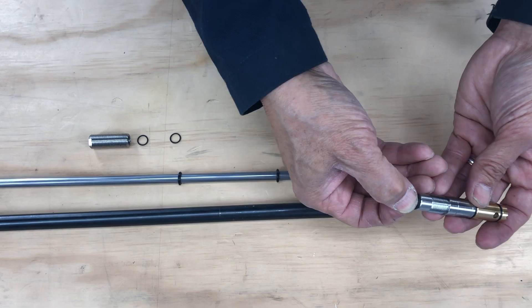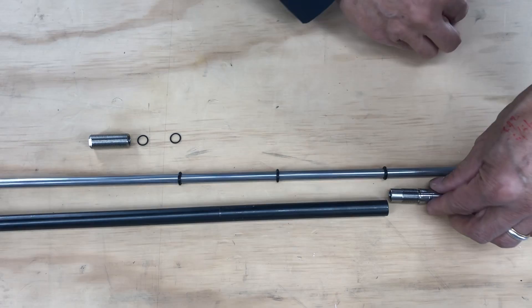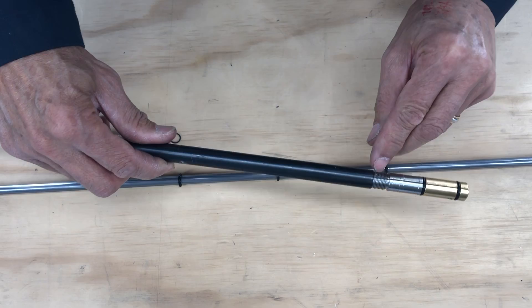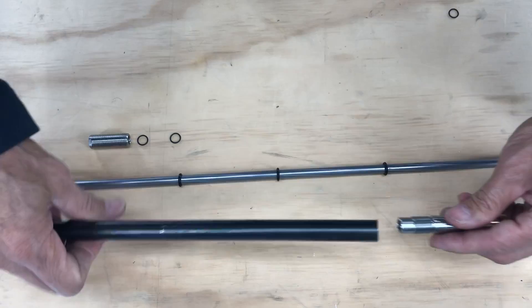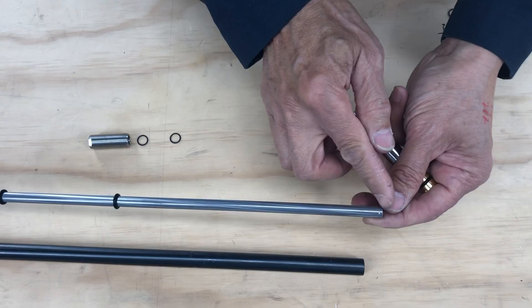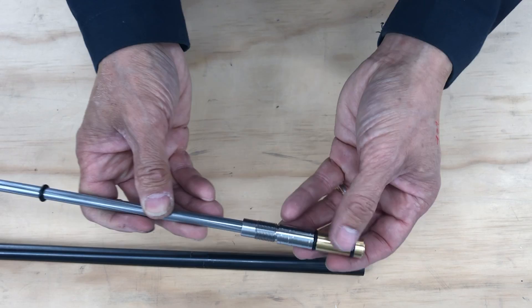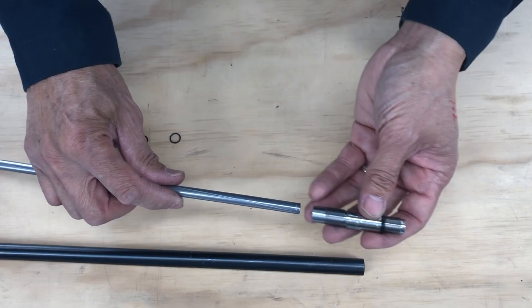Make sure you put your 8 by 1 o-ring in here. I don't have the tool but we're just covering how to assemble it — pretend I just put it in. Then your sleeve goes on with a couple drops of blue loctite also. Going back: when you put the liner in, make sure there's always a groove here so you can tell which end is the choke. Make sure it goes in smooth, not jamming, all the way to the brass piece.